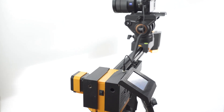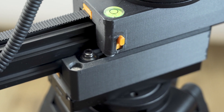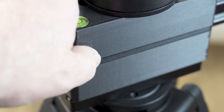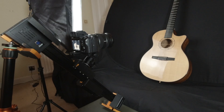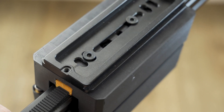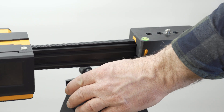On the camera carriage it's equipped with a quarter inch screw to which you can attach a 3/8 adapter for versatility, and next to this is a small spirit bubble to help with leveling. The small yellow button on the side of the camera carriage locks the two carriages together allowing you to move the slider to a new position. Underneath we have four magnetically restrained fast-deploy flip-out feet for added stability, and another quarter-inch mount point so you can use a small tripod head with a ball mount to angle the slider for elevated moves. On the bottom of the lower carriage we have a standard 120 millimeter Swiss plate which allows us to quickly mount the slider to a sturdy tripod, effectively doubling the slider's reach.